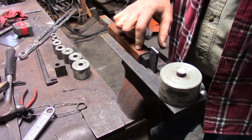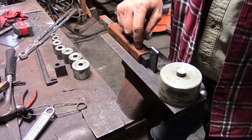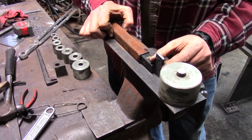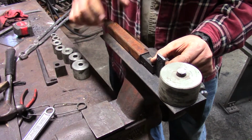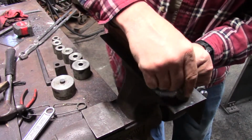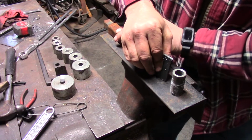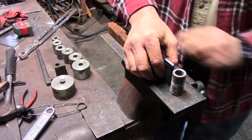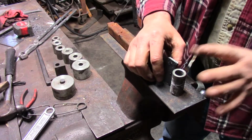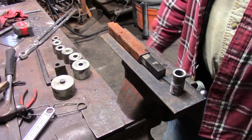I don't think I need more than one set screw. We're going to drill a hole, weld a nut, put a set screw here, and that'll allow us to set this wherever we need, even for the smallest die, which should be setting right in there. We'll be able to move this in to whatever we need, lock it in place, do our little bendy, and then presto changeo, it's got to work. It has to.